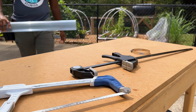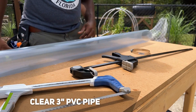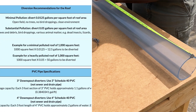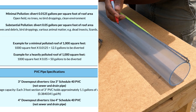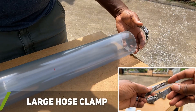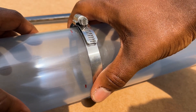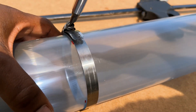Afterwards, using a hacksaw, I cut 3 feet of 3-inch PVC pipe that will be used for my first flush chamber. Depending on your environment and the size of the roof used to collect rainwater will determine the chamber length needed for your application. I will provide a link to the diversion recommendations in the description below. To assist with cutting the pipe straight, one tip was to insert the PVC pipe through a large hose clamp and align and tighten the clamp where the pipe needed to be cut. This provides a straight guide for the hacksaw to brace up against.